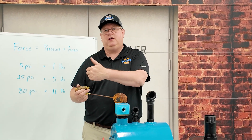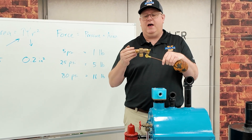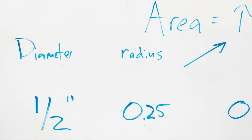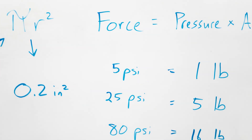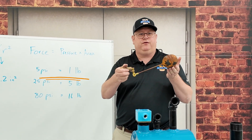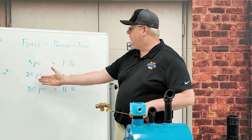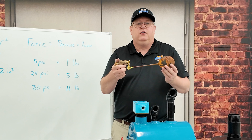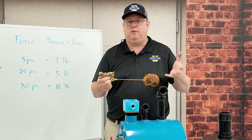A less common or overlooked reason that tanks can overfill is because of the incoming pressure. This trough valve has a half-inch valve seat. So if we look at that diameter divided in half, pi r squared gives us 0.2 square inches of surface area. So if we've got a modest water pressure going to that float valve, it only takes a pound of force to close it off. But if the feed tank is being supplied by 25 pounds or even 80 psi, it may take 16 pounds of force to shut this off. We may overfill or not, depending on fluctuations in city or plant pressure.